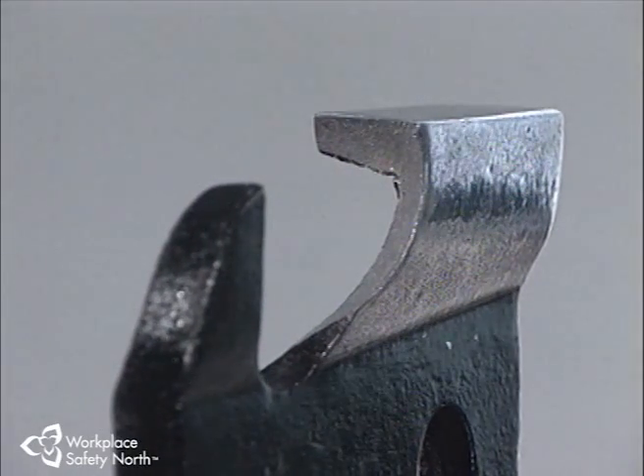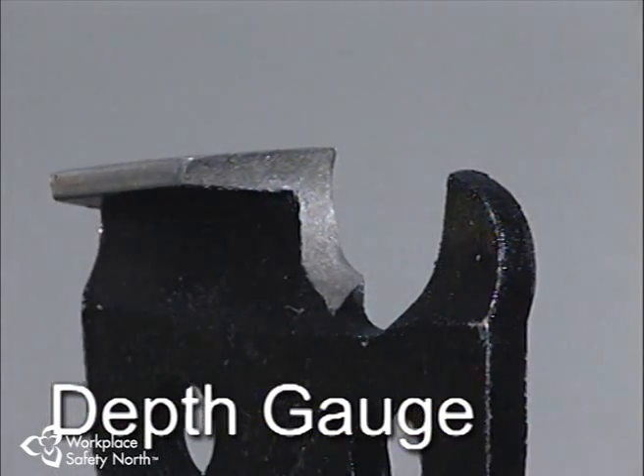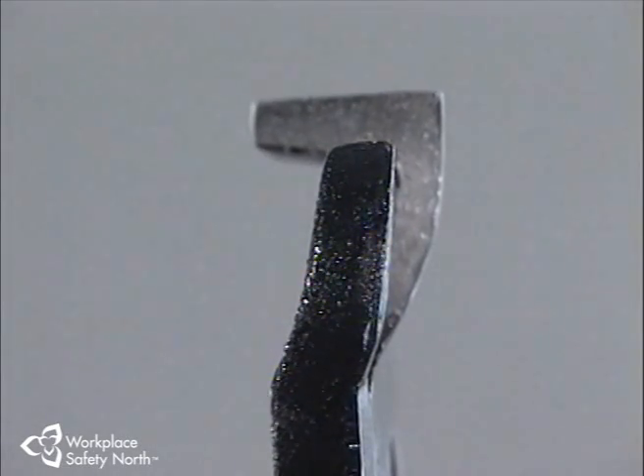The shape of the top plate and side plate will quickly show the difference between round and square chains. The depth gauge is located in front of the cutting edge, and its depth below the top plate — measured in thousandths of an inch — determines exactly how deep the cutter will bite into the wood.